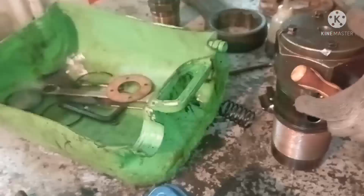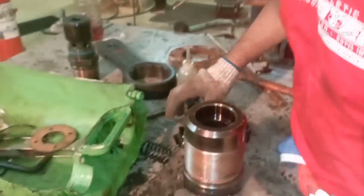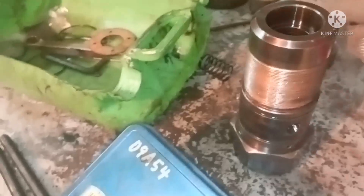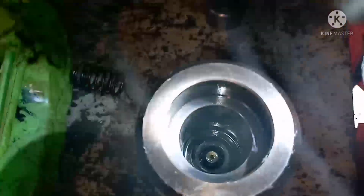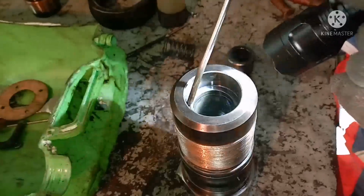So next, okay, locking was done, so we go for the other side of the puncture valve. First thing, as I said earlier, you have to ensure your valve seat is proper. Once that is done, you blow air, and also ensure the inside of the puncture valve is clear. Check for any dirt or something, blow air again, proper air, so that all the dirt will be out.